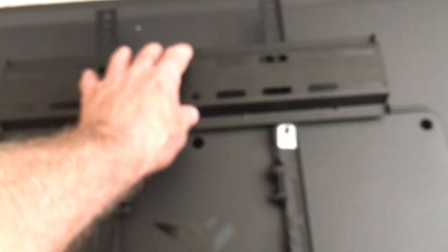So keep that in mind when you are hitting studs, you're going to have to mount this bracket a little farther to the left or farther to the right, but just make sure that you've got enough room to slide that TV where you want it before you decide on it. And if the bracket just isn't long enough, well then forget the stud, because those mollies that I told you about are going to be the answer.